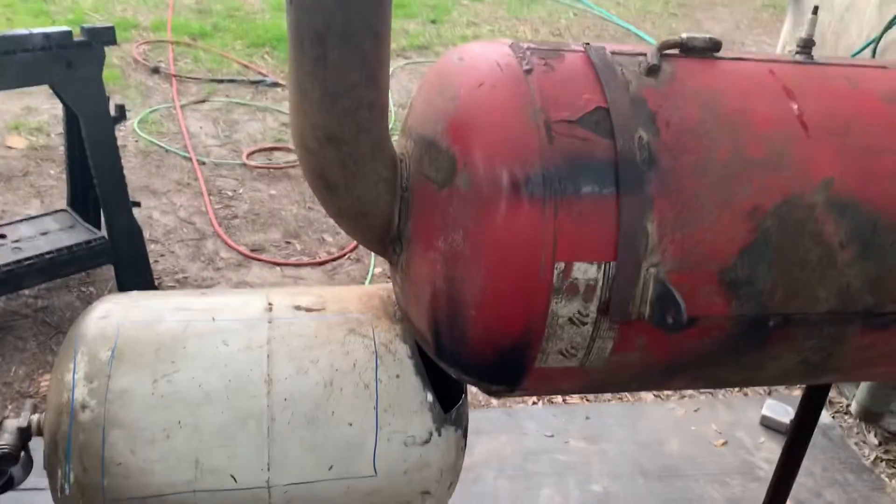I plan to have a wood handle here of some kind just so it doesn't get hot — if you make a metal handle it's going to be pretty hot. I also added a drain here; I repurposed this bung — I want to say it was like a two-inch pipe thread. I cut it out on that side for the exhaust so I repurposed it over here, and I kind of borrowed this pipe from work. I'm going to add a ball valve here for the drain for all of the juices and grease. I'll probably angle this up just a little bit so everything will fall to this end and go to the drain so it's not trying to run back into the firebox.